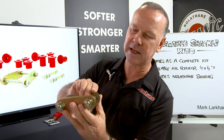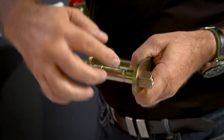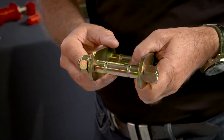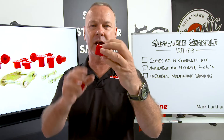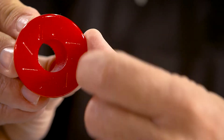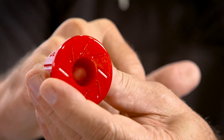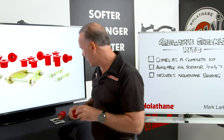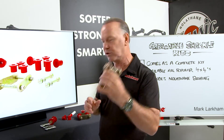The other thing I like — if you look closely here where the grease goes in, there are twin holes for the grease to come out and a really nice little recess. And if you look inside, you'll see the knurling — great for the dispersal of the grease, but even better for the retention of the grease. Put that together and you've got a really good long-term solution.